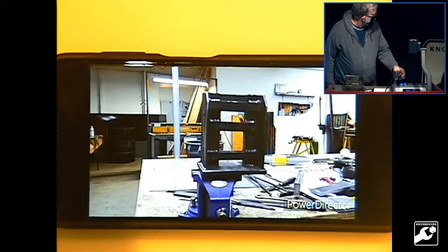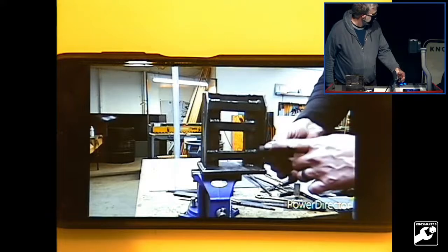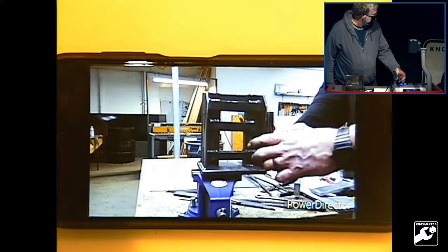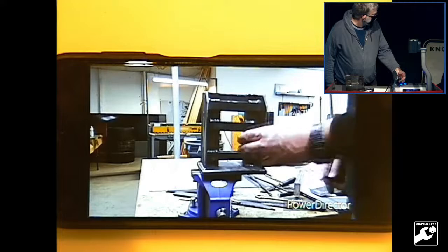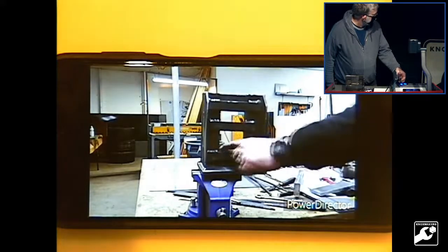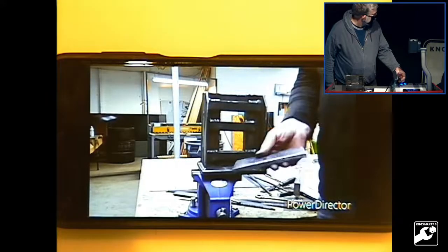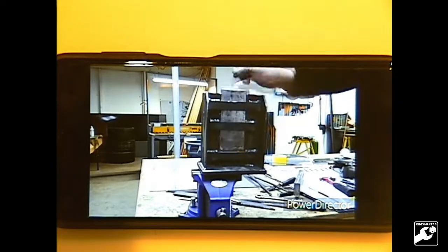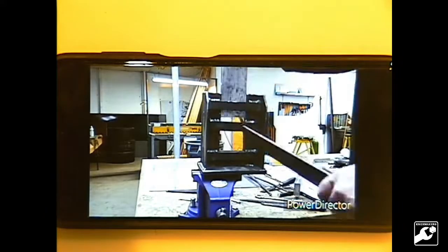Bottom die, which is a half inch thick block, and we'll weld a 3/8 bolt across there. Use a grade 8 bolt so it's heat treatable and will harden up and will withstand the wear and tear of being pounded on. And that'll just drop straight in. Obviously with a bolt on it'll sit a little higher. And then we take the top die and we weld a 3/8 bolt to the top and the bottom, so that the striking surface and the forging surface are both hardened and will withstand the wear and tear.